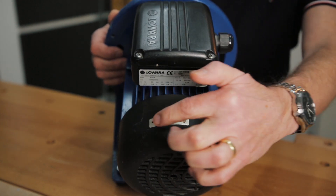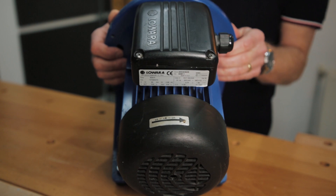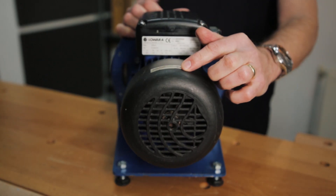That gives less capacity and less total head, but nobody notices it. How to check the rotation direction for a dry installed pump: I have a dry installed small one in front of me and I want to show you the fan cover. On that fan cover there is an arrow, and that arrow tells you the right rotation direction of this pump. If you start the pump, you can see through the grids of the fan cover the rotation direction of the fan, and you can check if it matches the arrow.